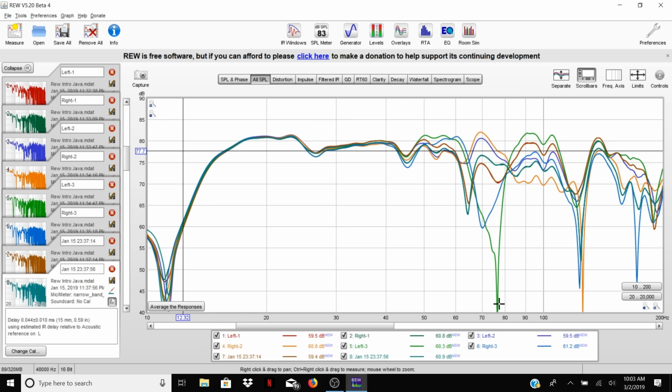There's some variation that we didn't notice before, and especially what you can see are those cancellation dips, and you can see that they seem to go on almost forever. In fact, if you look at them, whereas the response is typically in the neighborhood of around 75 to 78 decibels, those dips are down around 30-35 decibels. And so those cancellation dips would be examples of areas where we wouldn't want to make corrections.